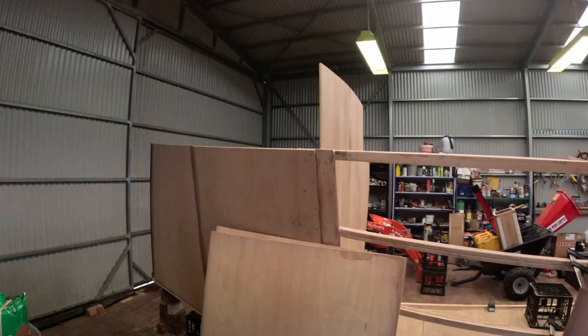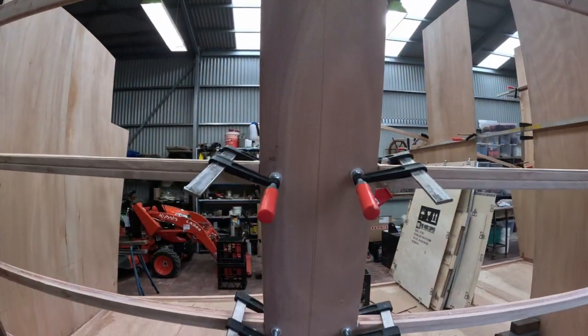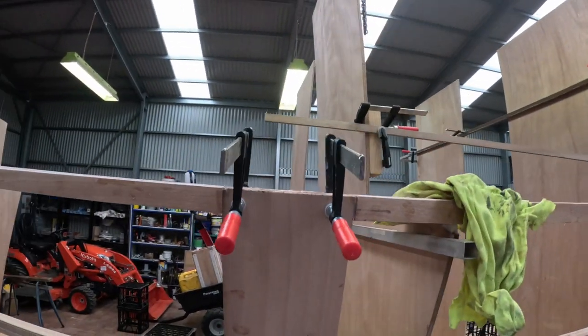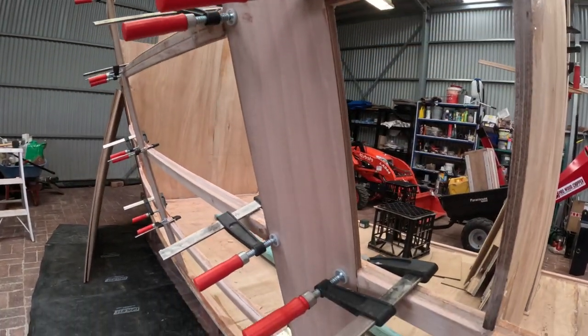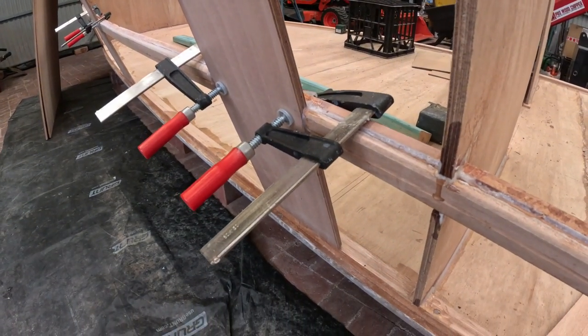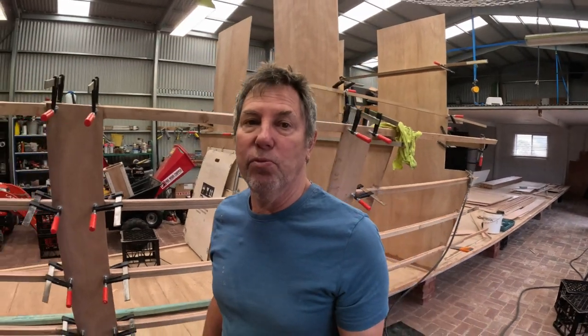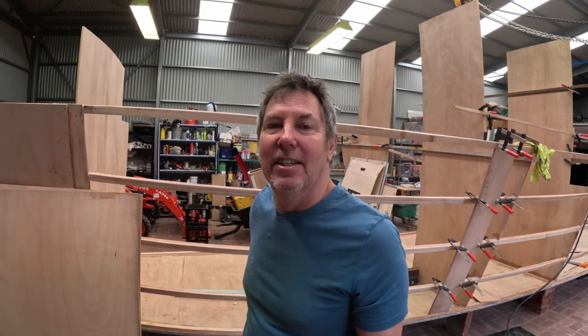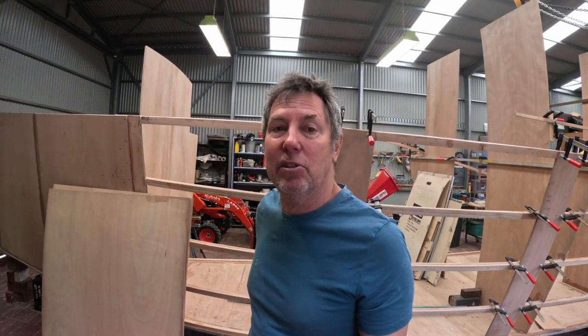I've just finished putting on some backing blocks, and once that glue dries I can put on the next two panels. Coming along from the front of the boat, there are my backing blocks in place — notched in through the stringers all the way down, but not notched into the bottom piece, because that gets glued into place as we go with the panels. Lots of progress today, but I really can't do much until that glue dries. It's also raining and gloomy, about one o'clock in the afternoon, so I think I'm going to finish for the day, go and do some editing, have some lunch, and put these panels on tomorrow.